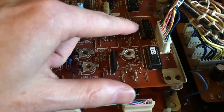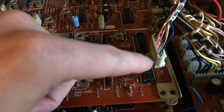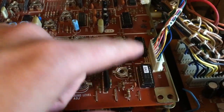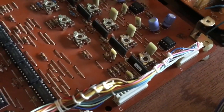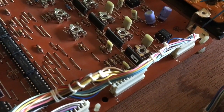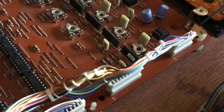I just swapped the envelope generator from the VCA, and suddenly I had nothing come out of the VCA, so I knew that that one was dead. So I've marked that one as bad. And the other analog fault we had was that annoying problem you were seeing with the sine wave, always turning the VCA off and on.